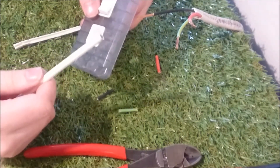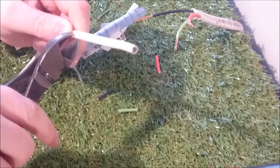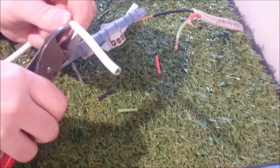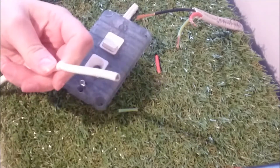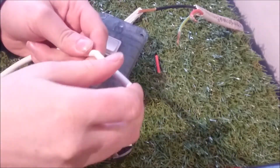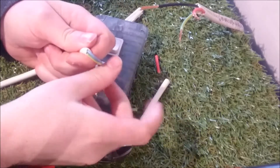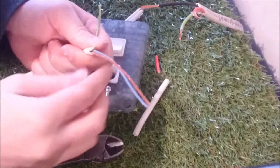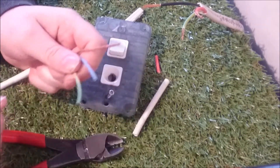Then what you want to do is strip the cable. You guys probably want to do it by knife or an actual flex cable stripper, which is like a sharp blade that spins around the cable. Because I'm experienced and I know the feel of these cables, I don't make marks on these cables where it breaks the insulation at all. After you've worked with these cables for a while, you actually get the feel of them, so you can do it with side cutters.